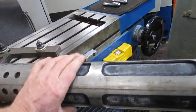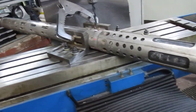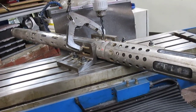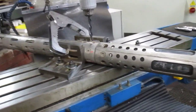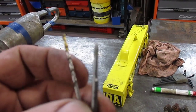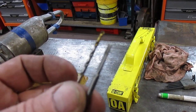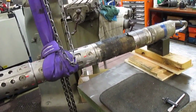So I've got to be extremely careful not to press or touch anything here — I've got to be gentle. This belongs to one of the larger worldwide companies that do deep hole exploration and monitoring. This morning I had a similar type of thing but without the encasing on it, and for that they were very tiny screws. This is a size piece that I was drilling out today — the drilling and tapping. It's a thread tap — that's a number 4-40 UN — and I've managed to remove nine of those today with another three to be done.